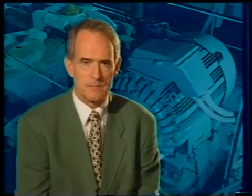This is Programme 4 of VideoTel series on practical marine electrical knowledge. The series is made up of 8 programmes. Programme 4 deals with 3-phase cage induction motors, showing the testing of each electrical component for continuity, between-phase faults and insulation resistance testing. Then we show how to dry out a motor which has been drenched in water.